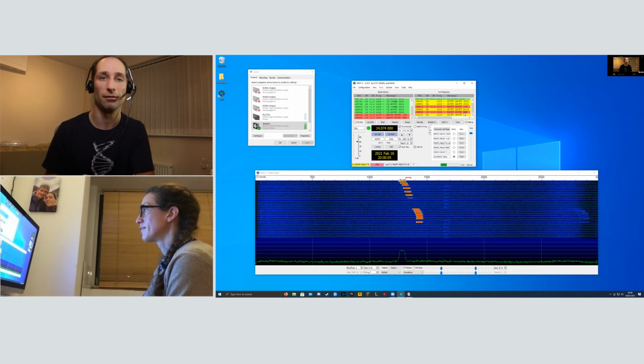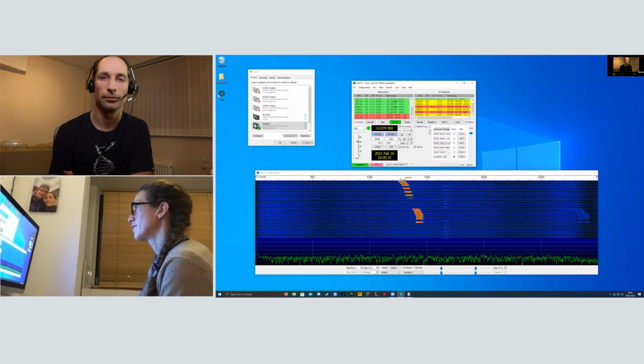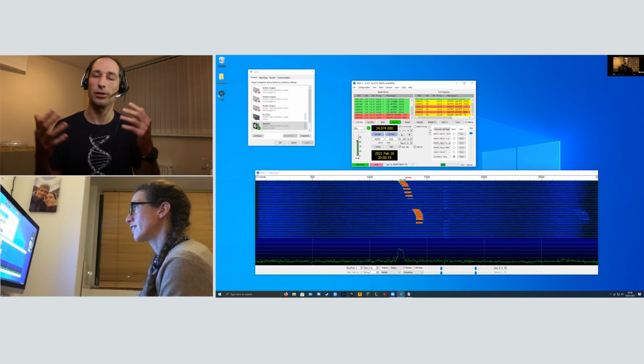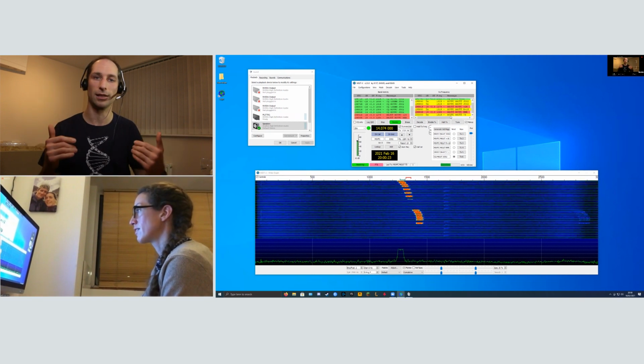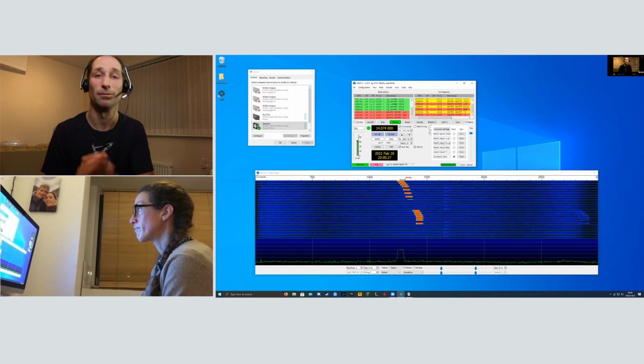I've got my report from you. That means you know that you've got my report. I know that I've got your report, and we can both say 73 to each other. And once it's completed that sequence, you'll notice that the Enable TX button is no longer lit up red. So you've just gone back into receive mode. And that's it. That's the QSO complete.